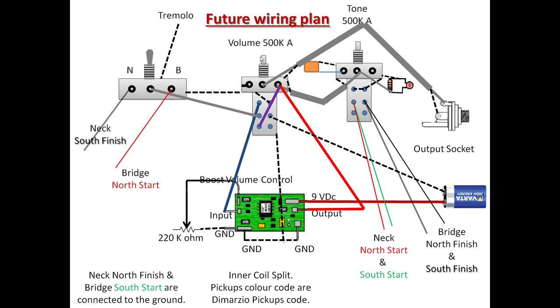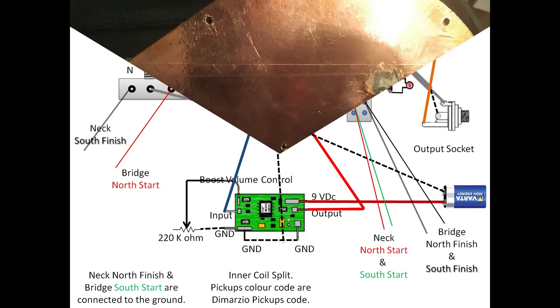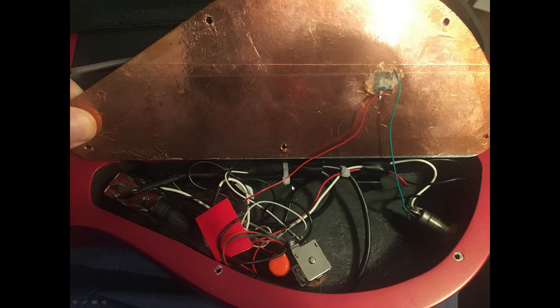I think this will be the perfect solution — I haven't tried it yet but I'm looking to do so. My other future plan is to add a piezo output using a stereo cable. The output socket is stereo mode with three pins: tip, ring, and sleeve (ground). The tip is for the magnetic signal, the ring can be used to switch the battery with a mono cable, but if I connect it to a piezo system with a stereo socket, I can have both magnetic and piezo pickups on a stereo cable and route them to my PA system.